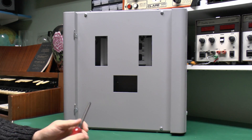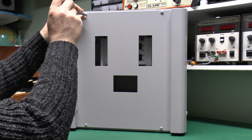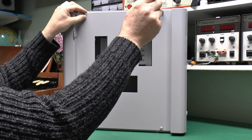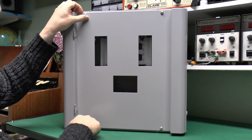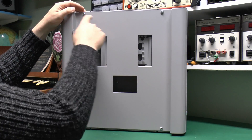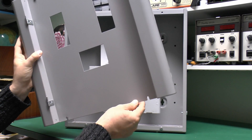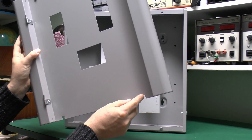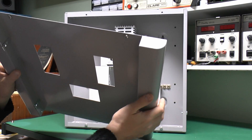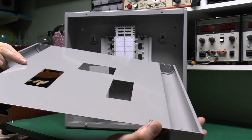Now just have a look inside. The cover on this one is secured with four screws — two at the bottom and two at the top. I've already loosened the two at the bottom. Notice that once you've loosened the screws, they don't actually fall out — they're held captive within the front panel. We only need to loosen them at the bottom because the whole thing will simply lift off. At the bottom, you've got slots rather than holes, so again all designed for much easier access.